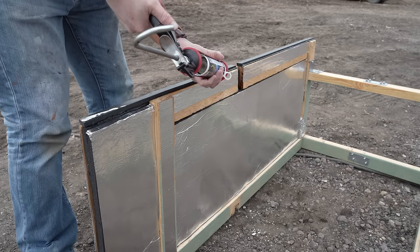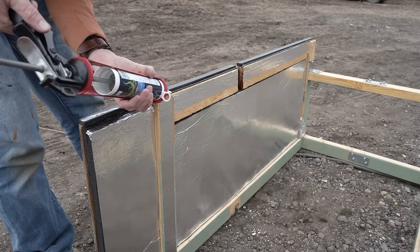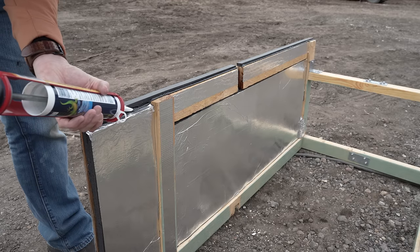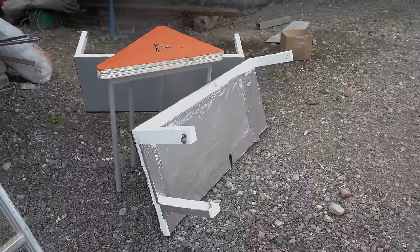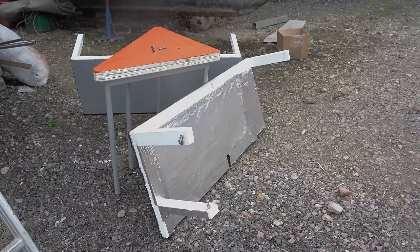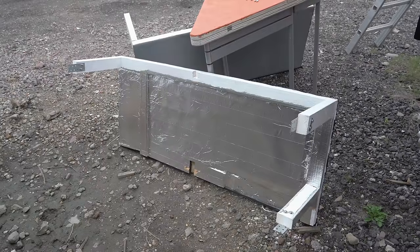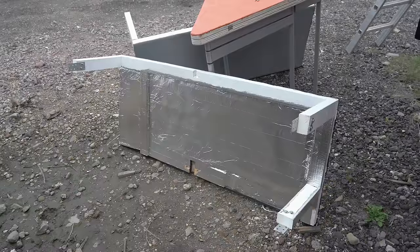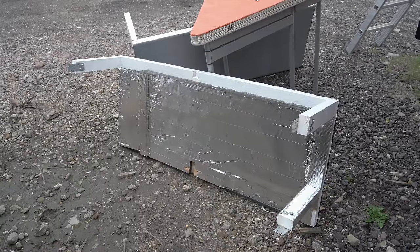There are no zones of really close proximity between the cowling and a hot zone like the turbocharger or unlagged exhaust pipe. The cowling is inverted here, and along the base I've bonded on a thick strip of rubber, then bedded it in with high-modulus sealant. This will, with some downward compression later, allow for a good seal with the gel coat floor once installed. I've chopped the cowling in half — I did this once happy that it sat squarely over the engine bay — and having jigsawed the three cross beams, I attached the two halves using stainless brackets and M6 nuts, washers, and bolts. Whenever I bolt wood I use a large penny washer to prevent the fixing from crushing the wood fibers.